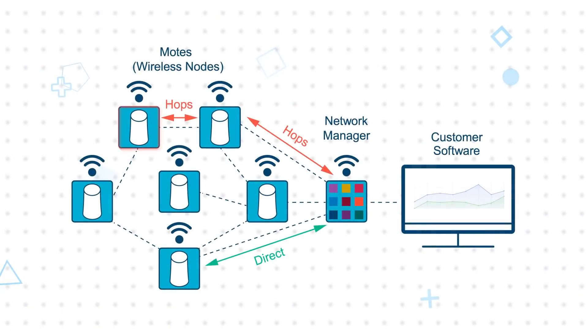The Voyager 3 kit supports ADI smart mesh mote hopping. This is where a mote which is out of range of the network manager can hop through an in-range mote. The multiple-hops network ensures that out-of-range motes can stream data to the network manager, which extends the reach and scale of the solution deployment, ensuring the reliable delivery of critical data.